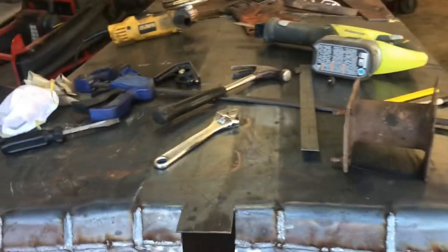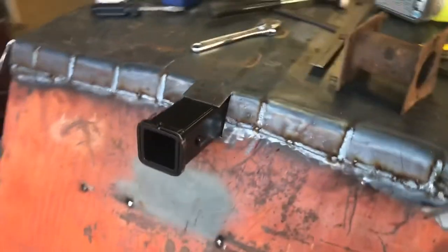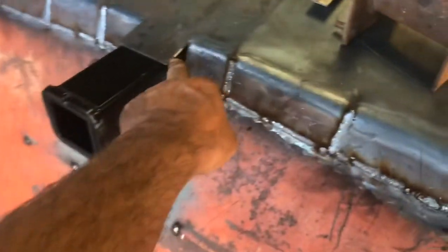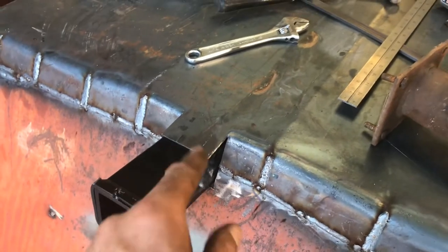The middle right here I'm leaving open because we're going to put a two inch receiver hitch in there. We're going to beat that up inside there and we're going to have the two inch receiver hitch on the coot. Then I'm just going to leave this tab on and we'll just weld that all up solid. Then on the very back of the back in here we're going to weld — I'll have to cut this down to make room for the axle.